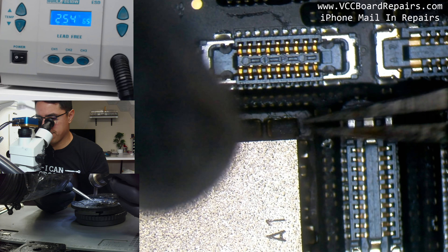This appears to be the culprit. If you look closely you can kind of tell it's a little brownish or grayish — you can see it's oxidized here, so most likely this is the culprit. Now here's the trick: it's right next to NAND which is very solid, so if I get a blade here I can remove this cap just by twisting the blade — it's enough to break off the pads off the cap. And now it's off.